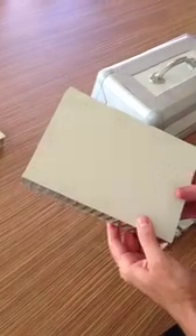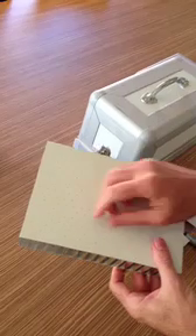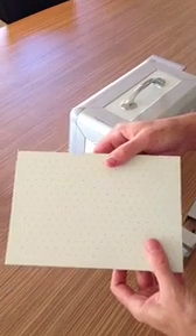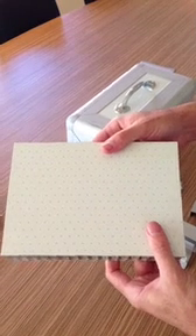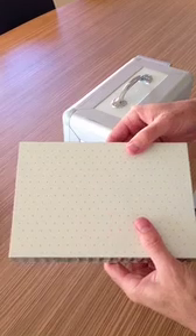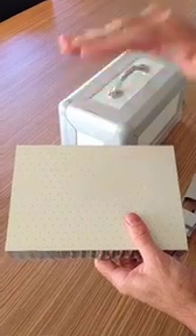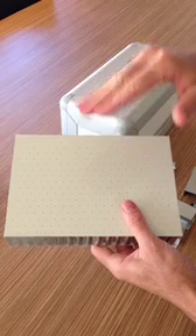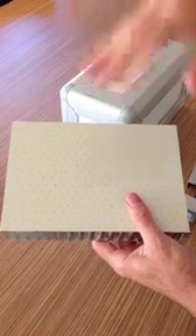It's a noise cancelling panel. It's a 100% aluminium honeycomb sandwich panel and the skin is micro perforated to produce what we call a Helmholtz resonance. It's a very similar phenomenon to when you blow across a bottle of beer or water and it makes a tune — basically the air in the neck of the bottle bouncing up and down on the air in the cushion within the bottle. It's a mass on a spring which creates a frequency and a note.